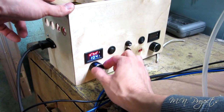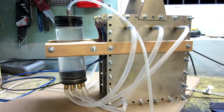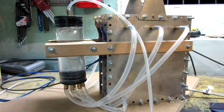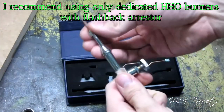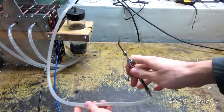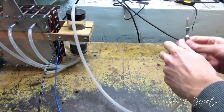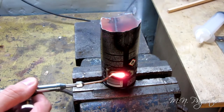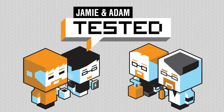This cell is taking about 15 amps at 25 volts, so you need quite a big power supply to run it. This is because of the electrode separation - he needs 25 volts. My own cell was originally running at around 2.5 volts and around 8 amps. I modified the power supply to give more voltage, and then it would run at around 5 volts at 10-11 amps. I also included a series resistor because the power supply is not adjustable. And then there's, unfortunately, the complete and utter rubbish - like this Mythbusters design.